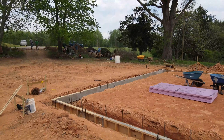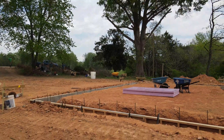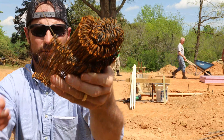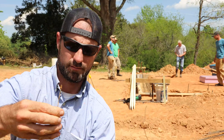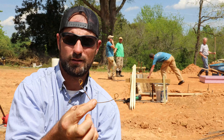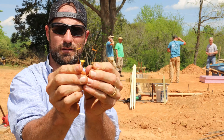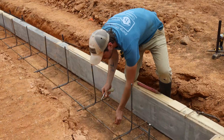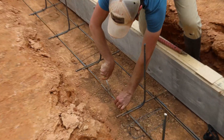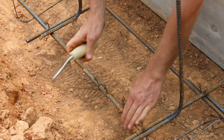You can use a spool of wire and cut eight-inch lengths and twist them around the rebar by hand to hold everything together, but that takes forever. So we use these preformed wire loop ties that come in a big bundle. They're available at your local concrete supplier and even big-box stores like Lowe's and Home Depot. Here's where the rebar twister comes in to save the day — this little thing costs about eight bucks.